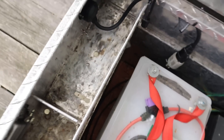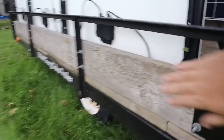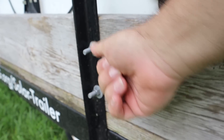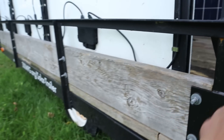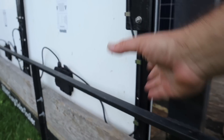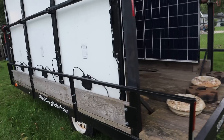There is a little extra space in here, so if you wanted a few accessories, there's room to throw them in. On the side, I've got a plank going across bolted down to the uprights with galvanized carriage bolts. On one of the steel uprights, I also welded a plate as an endpoint for that to go into. Basically, what this board does is give a solid point of contact for when the solar is folded up, so it can be pinned to the board to prevent vibration while going down the road.